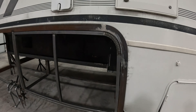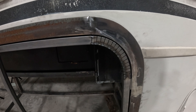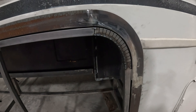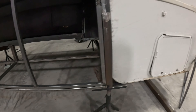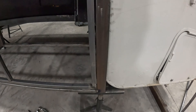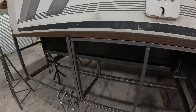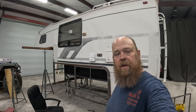The second door on this side is done. Not going to lie — this made me work, this was a hassle. Not necessarily doing the bend, but getting everything pretty close to lined up. It's not too bad, good enough for what I want. Gaps are looking pretty good, although one spot keeps opening up on me — it closes and then opens. I'm pretty happy with it overall. Next thing is to finish weld this one out and then start working on the sheet metal for this side. But it's pretty much done for the day, and we'll pick this back up tomorrow.